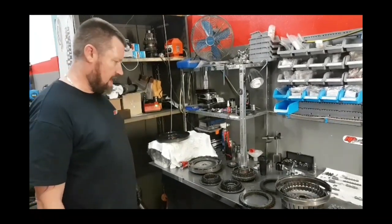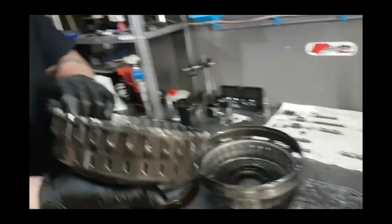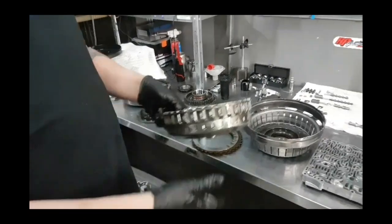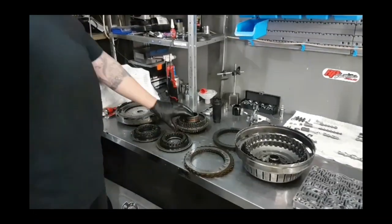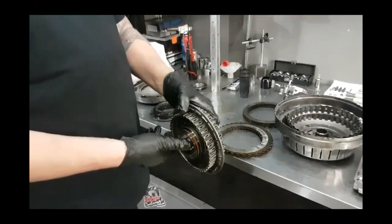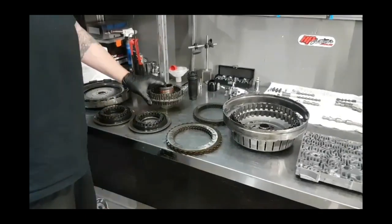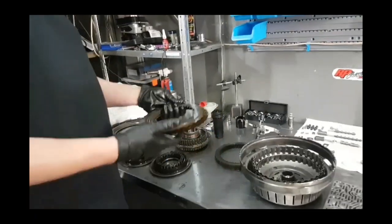Once we have that off, we're able to get into the clutch area. There are two clutch baskets — a small and a large — which go over the respective clutch plates. Once we get in there, we have our clutch hub, and on our clutch hub this is where our clutch plates are located for odd and even gears. Basically once one's engaged, one's not engaged and vice versa — it just keeps switching, which allows fast gear changes as long as there's no slippage.